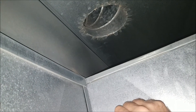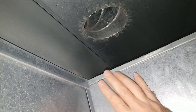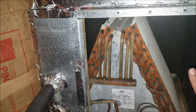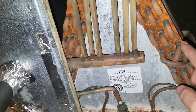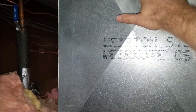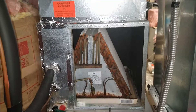Here's the air handler with the cover plate removed. My refrigerant lines come in here and attach to the A-coil. As you can see, this thing is pretty much rotted out — it's overdue for replacement. All this will come off and I'll have to redo the duct work. I should have about four or five inches to work with after I put the new unit in and make some custom duct work. This whole furnace will come out and the new one will slide in.